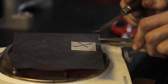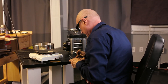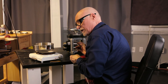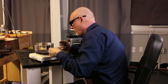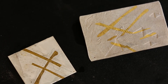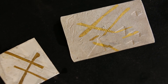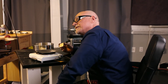On any gold alloy, exactly the same thing. On platinum, you need to go hotter — it needs to actually be a bit of a glow. Here you can see that I have roller printed this material. How lovely that looks on the gold where the paper is pressed into the gold. And there we go — that's Keum-boo, a wonderful addition to your vocabulary of jewelry making and metalsmithing.